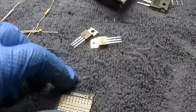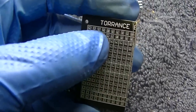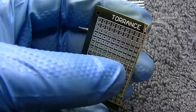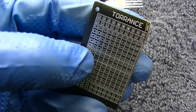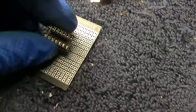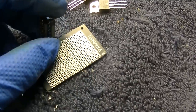You just have to look at your board and figure it out. On this breadboard it's not real intuitive how it is - these rails are connected this way and this way, then these five are connected. And then unfortunately instead of these rails being connected all the way across, that's just two, two, two, two. I told the guy that designed this board: create one solid bus at the top, one solid bus in the middle, and one solid bus at the bottom, because your IC goes in the middle, so you've got a ground bus there.